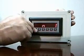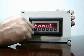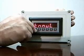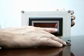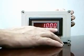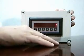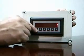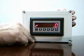We have our conversion factor of one. The next measure is if we want to scale the totalizer to read not directly in gallons, but some decimal multiple. I can choose from reading in gallon units, tens of gallon units, hundreds of gallon units, or thousands of gallon units. You can choose the multiplier that best suits your need to represent your total on the instrument. As I complete each group, it returns to the run mode.